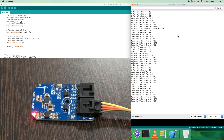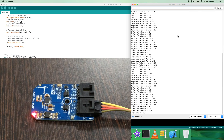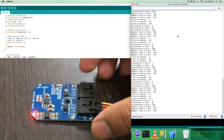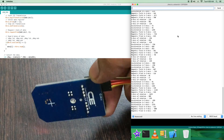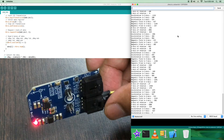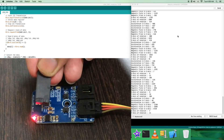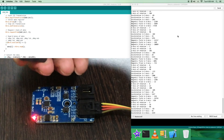Open the serial monitor so we can see the output on screen. We have the X, Y, and Z axis of rotation, acceleration in all three perpendicular axes, and the magnetic field in X, Y, and Z axes. The values are almost stable because there is no change to the sensor. When I try to rotate or move the sensor, you can see changes in the acceleration and rotation for all three axes, and some movement for the magnetic field. Also, when I bring a magnet near the sensor, you can see changes for the magnetic field in X, Y, and Z axes.